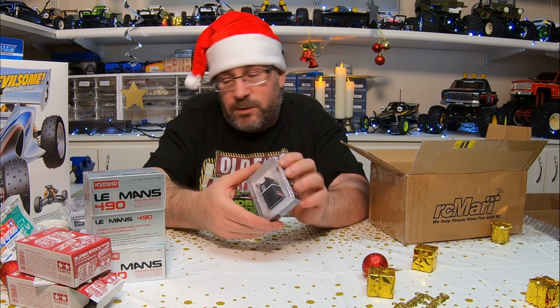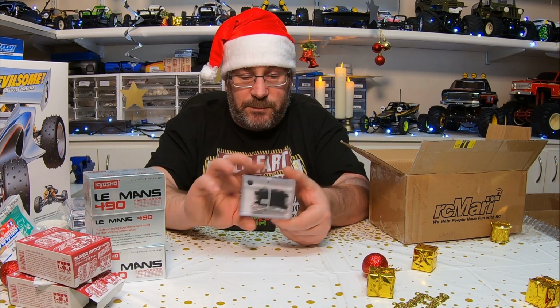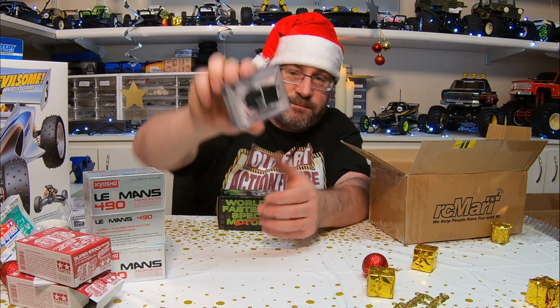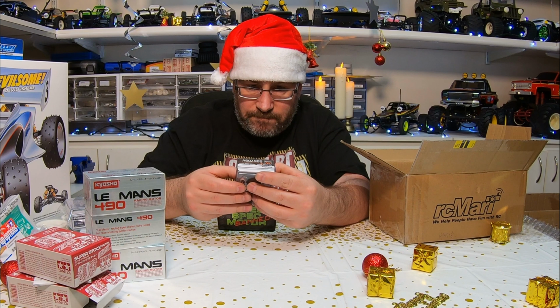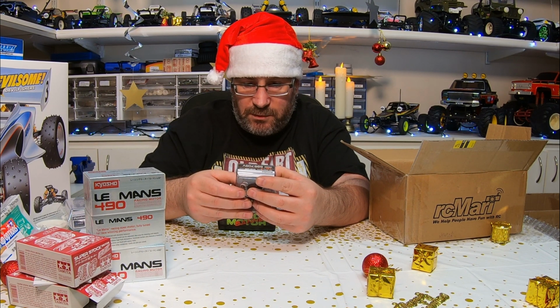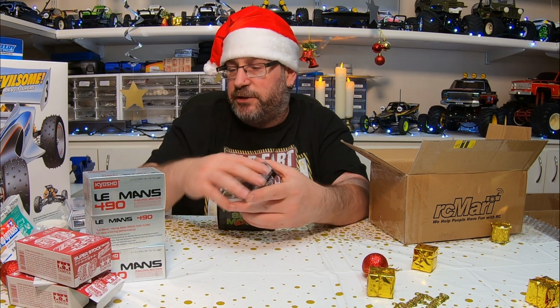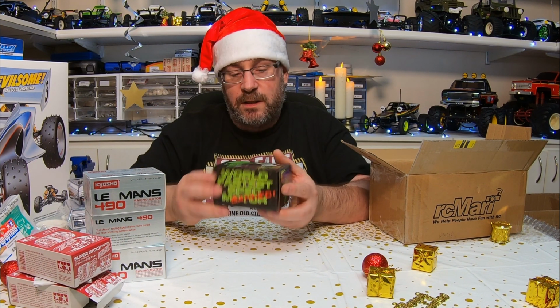So I figure I'll just go for Futaba, because somewhere in here he ran a Futaba steering servo. I might as well go with a Futaba receiver and then I'll use my Futaba 4PX on it, with a low profile servo, reasonably high speed. At 7.4 volts, it's 0.08 seconds for 60 degrees, not bad. Oh, and here we go.